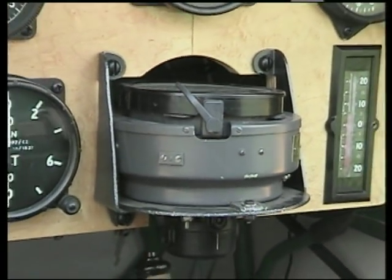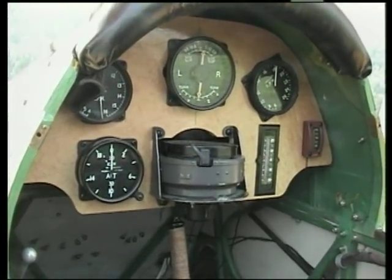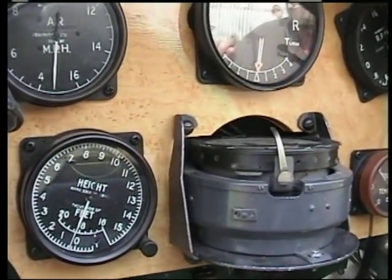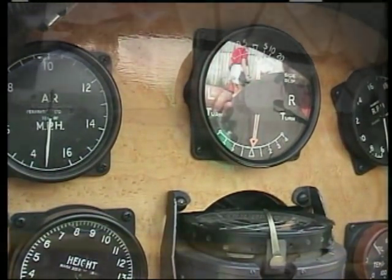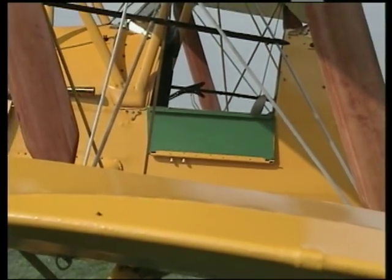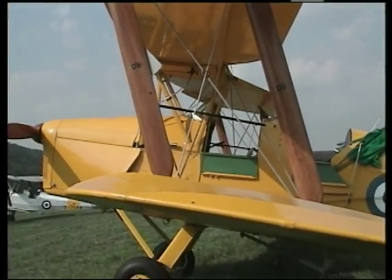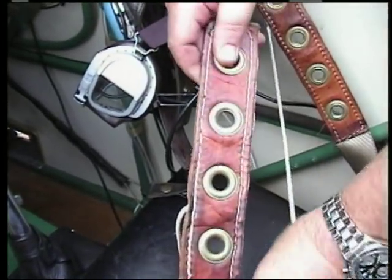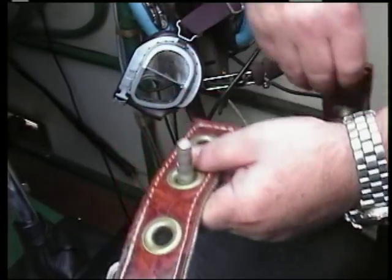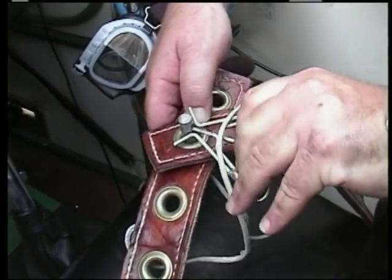And so I got the airplane home in boxes, photographed everything, tried to take an inventory. They didn't use exploded parts diagrams back then. There was a name of a part in a book, and it's a different name in England than it is here. Even though it's English, these are not called wings, they're called planes. And that was just the beginning of the education. The fasteners are 100% different than on American-built airplanes. And I began the meticulous work of piecing these things together and trying to get it to come into the form that you see it now. It took me a couple of years.